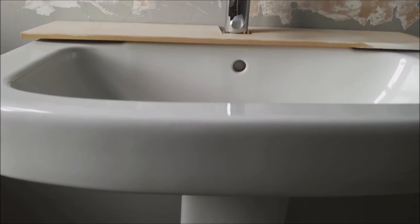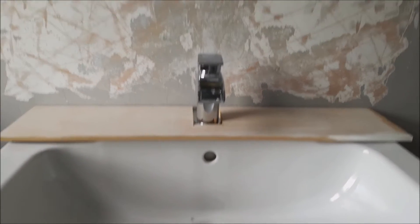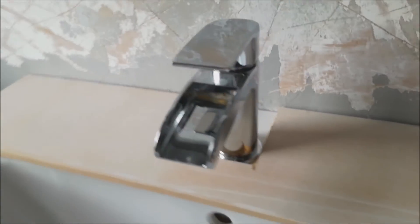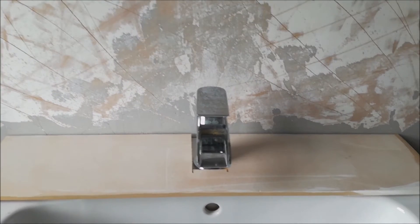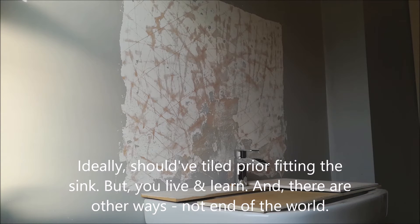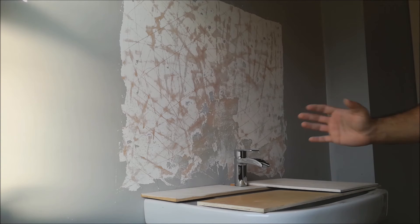The reason for the gaps on the two ends is because of the way the sink is designed. I'm going to do the tiling and I've cut out a nine-millimeter off-cut board to go around it, so the tiles will sit on that and I'll get a straight finish — that's the purpose behind it instead of using a batten. I just realized I should have covered the top of the sink because the adhesive is really sticky and that'll be a pain to remove. So I'm using an off-cut to hopefully prevent any spillage. Anyway, let's do this.